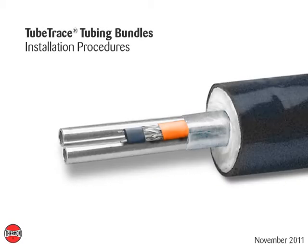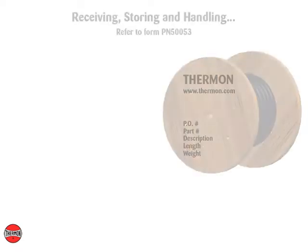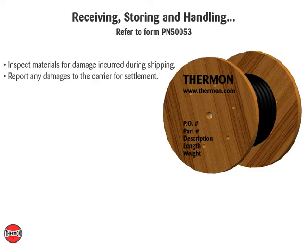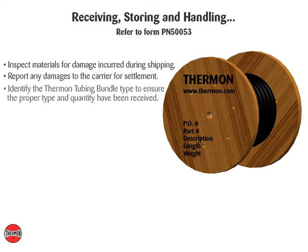This video covers basic installation details of Thermon TubeTrace instrument tubing bundles. Receiving, storing, and handling. Inspect materials for damage incurred during shipping. Report any damages to the carrier for settlement. Identify the Thermon tubing bundle type to ensure the proper type and quantity have been received.